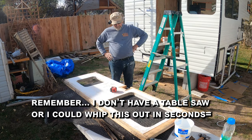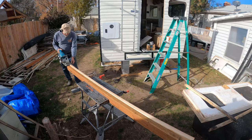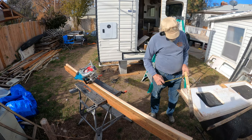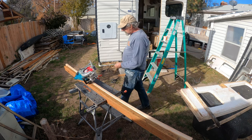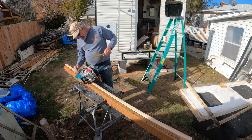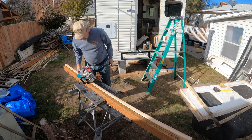I'll have to mill a piece of lumber. Let me grab my saw. Set the blade depth — it needs to be one and five-sixteenths. That figures it'd be an odd size. Setting it to one and five-sixteenths, open up — that's two and a half full depth, let's go to two. Okay, that ought to do it. Wish me luck.